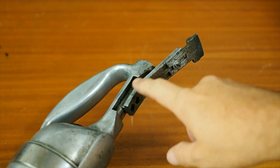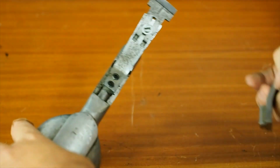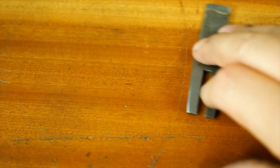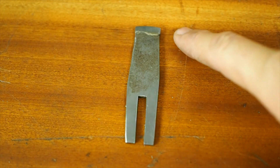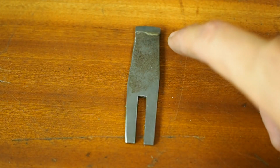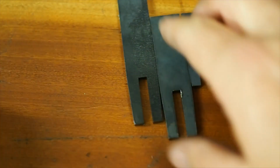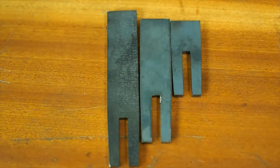It came with both one long and one short tool holder, one pretty large and one extremely large carbide blade. I made up this blade just out of a piece of old steel with a bit of carbide braze to the end of it with a much tighter radius, I think this is a 60, to better for spotting and fine scraping. And also, last time I had a laser order, I got three more parts lasered in different lengths.